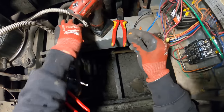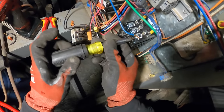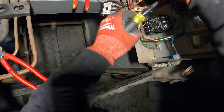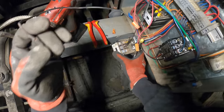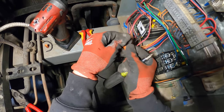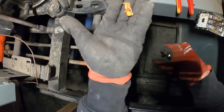Let's get this right in place, get rid of that — the wire looks good. Could have also had some loose connections with those wire nuts. I hear some alarms going off — there's a construction site over there. This wire here is just eaten up. Look at this wire nut, how it melted — incredible.